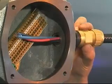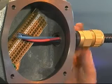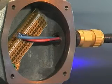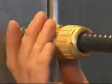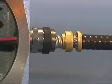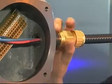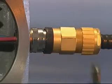Bring up the middle nut and tighten onto the entry component using a spanner or wrench until the grounding ring grips the metal armour sheath. Tighten the middle nut an extra half turn with a spanner or wrench. Unscrew the middle nut from the entry component and visually inspect that the armour grounding device has clamped the metal armour. Push the cable into the entry component and hand tighten the middle nut and back nut onto the entry component. Using a spanner or wrench, further tighten by half a turn the middle nut onto the entry component.